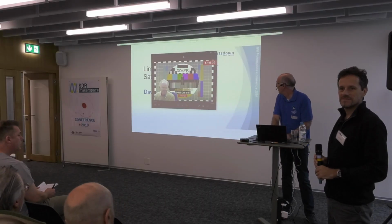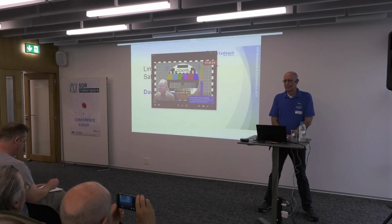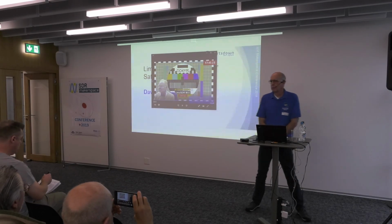Questions? Why did you choose DVB-S for terrestrial transmission? Why not DVB-T? We could generate DVB-S using this crude hardware. DVB-T was very expensive to produce, and we couldn't get any equipment to produce it easily. We can also reduce the bandwidth of DVB-S down to very small, 100 kilohertz, whereas with DVB-T there's 8 megs, 6 megs, 2 megs, 1 meg, but it is not so flexible.